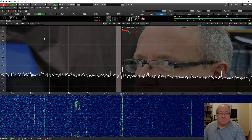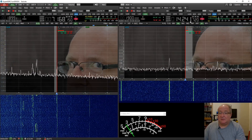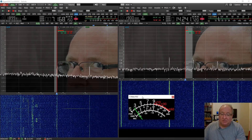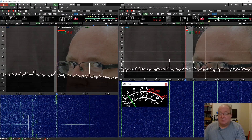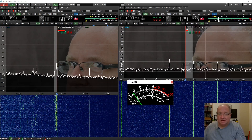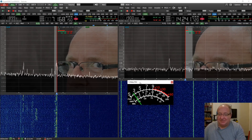Here you can actually set up two receivers - I click on that and now it splits into two. So now I've got one on 7 MHz and one on 14 MHz. It will probably change the amount of bandwidth available on both. On this one I've got a nice little level meter on the side which I quite like. Bear in mind the noise is low on 14 MHz because I've got a manual tuner here that isn't tuned for 14 MHz.